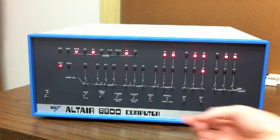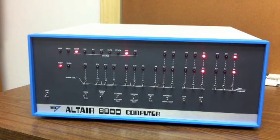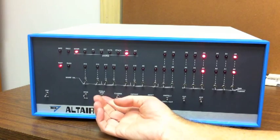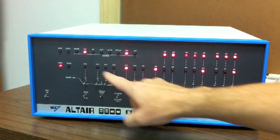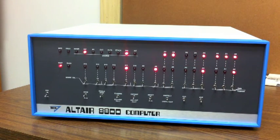The next instruction is an input from IO address 9. When we read from port 9, this is what's called the sector position register. Here we're doing the input from IO address 9 and we get a pretty interesting display — we haven't seen this kind of active display before when examining memory. What we're seeing is essentially an open window to the sector position register, and that register is getting updated rapidly by the controller card.